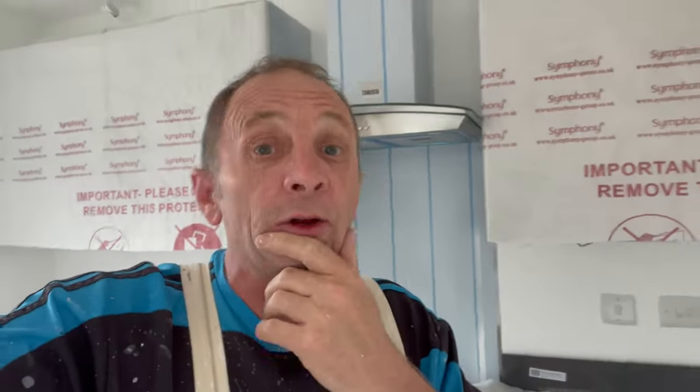Question is, would I recommend buying it? I don't know how much it is, but I do think it's a good paint. I do. Very nice paint indeed. Dries very quickly. You do need to thin it down, and it flows on nicely then. You get less brush marks. Ideally sprayed on, wouldn't you? But for brush and roller application, yeah, I think it's sound, absolutely sound, good stuff.